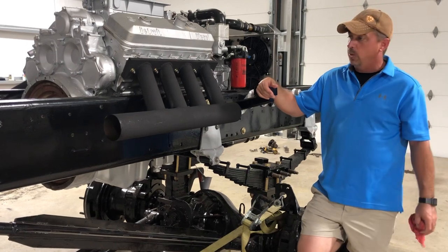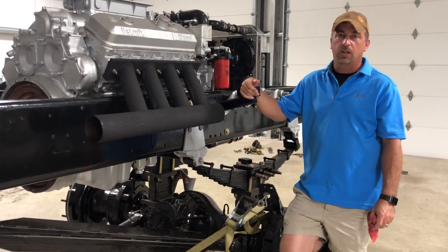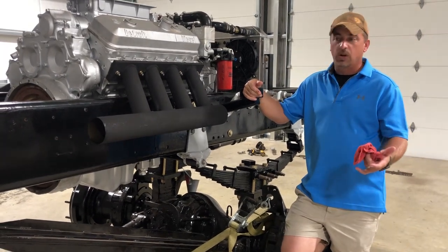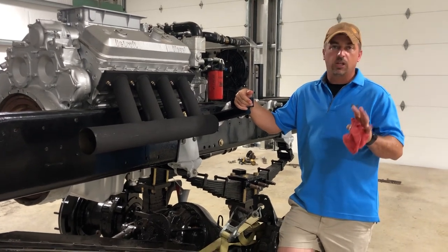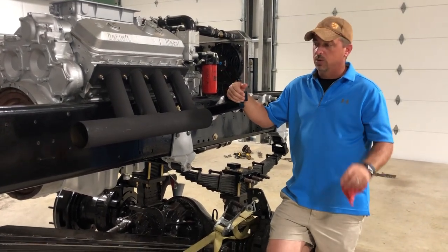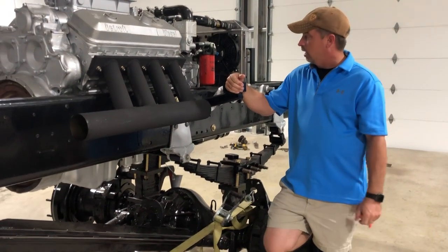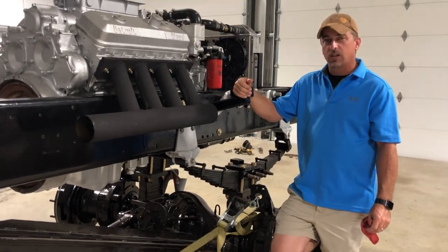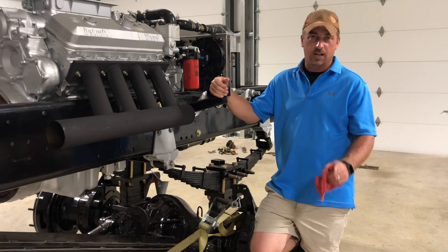So we'll dump that out and put the 40 weight back in — most of that slobbering should quit. I ran temperatures on every cylinder with the temp gun, we've got good temps, all the injectors and racks are set correctly, and the banks are running even. If you listen to it, it sounds really good and we don't have any real smoke. We'll get the 40 weight in it and hopefully get the slobbering cleaned up. I've got a little bit of touch-up work to do, but I just wanted to answer some of those questions. Thanks for watching — please like and subscribe.